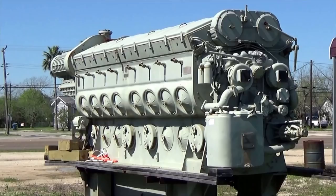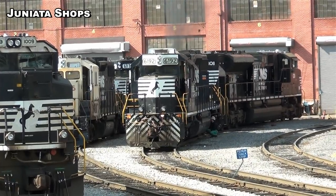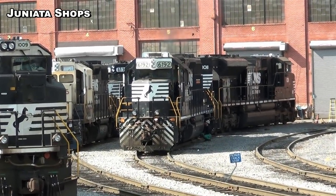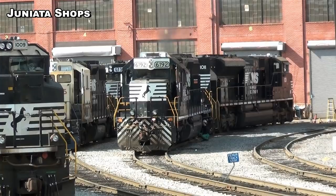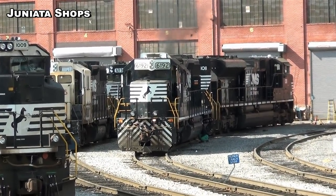The engine is a uniflow design with four poppet-type exhaust valves in the cylinder head and charge air scavenging ports within the sides of the cylinders. All engines use a single overhead camshaft per bank, with exhaust valves operated by two cam lobes and one cam lobe to operate the unit injector, which is in the center of the four exhaust valves. Cylinders in each V-pair are directly opposite each other, and since all rods are always in compression, the connecting rods use a simple system of fork rods on one bank of the cylinders and blade rods on the other, with the same stroke on both banks.